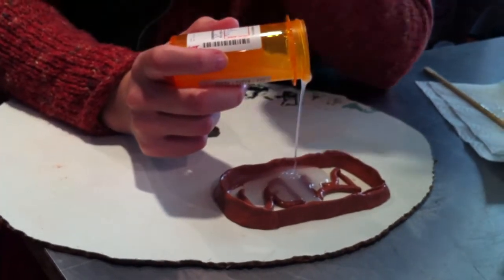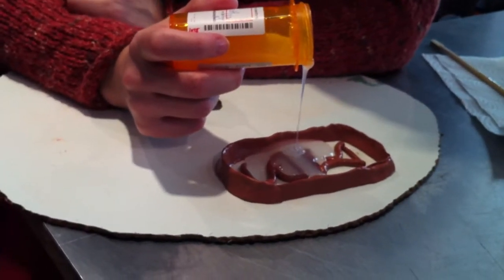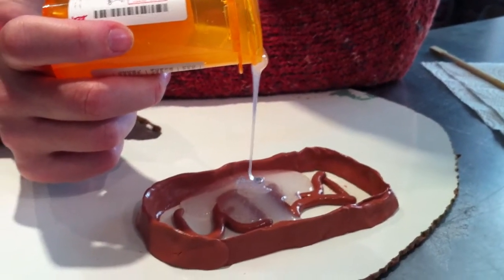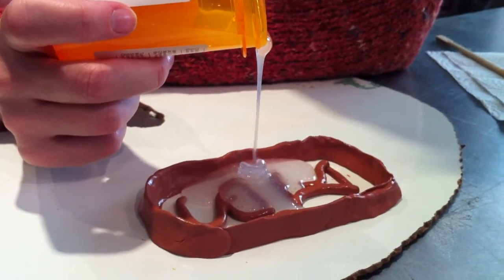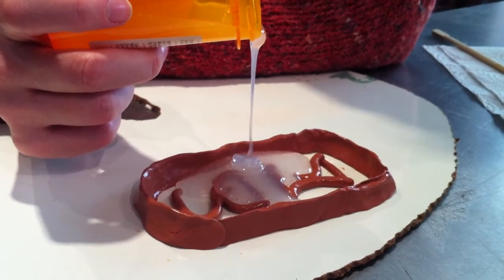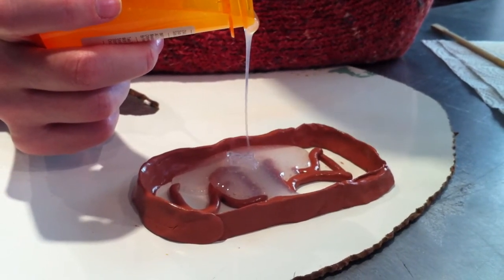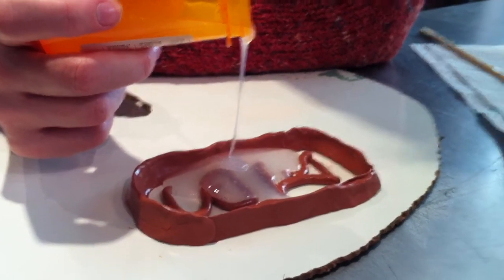Is the clay baked hard or is it just... It's plasticine clay, so oil-based. But I have sprayed it with a sealant because the Platinum Cure silicone — which is what this is — sometimes doesn't interact too well with oil clay, specifically clay that has sulfur in it. And I don't honestly know exactly what I've got here. It was recommended to me that I put a sealant on it, and for my tests the sealant worked fine, so I just decided to continue doing that.